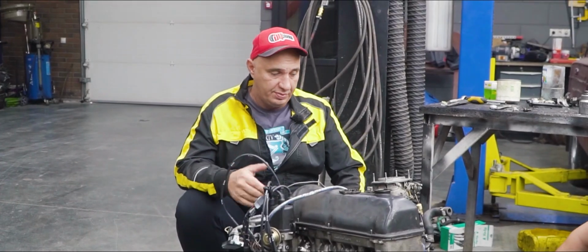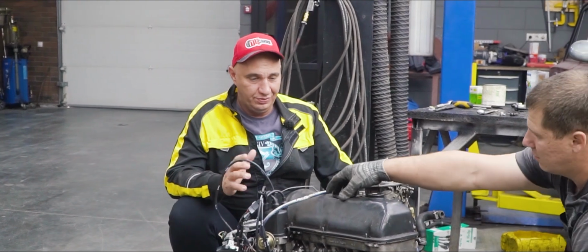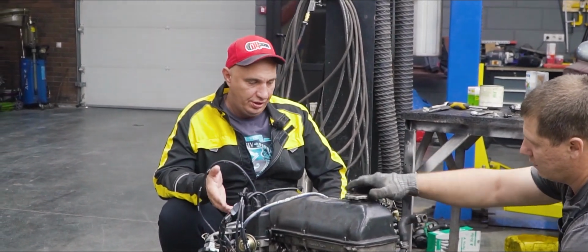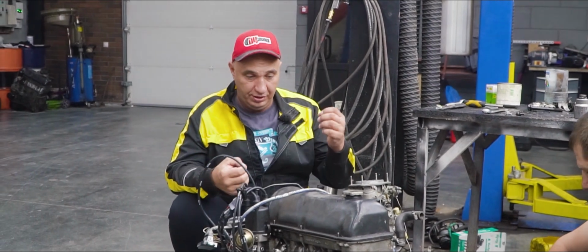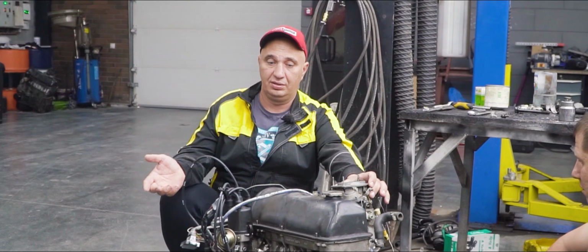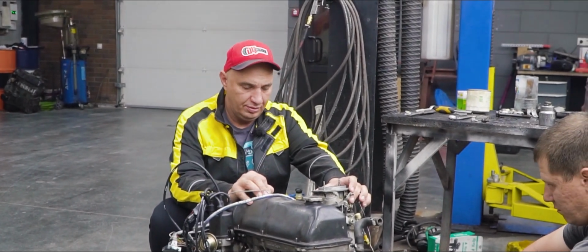Okay, we are looking pretty good here. We've assembled the engine with its welded crankshaft, we've got all of the associated components attached, even the spark plugs, though there are still a few connections to do up. Now for starters, the first thing we need to do is spin it up with the starter motor, to avoid a situation when we've already placed it into the car and it refuses to be spun up by the starter. Let's try this out.